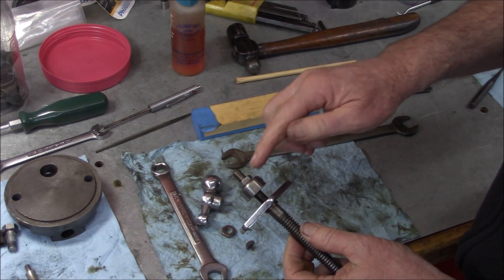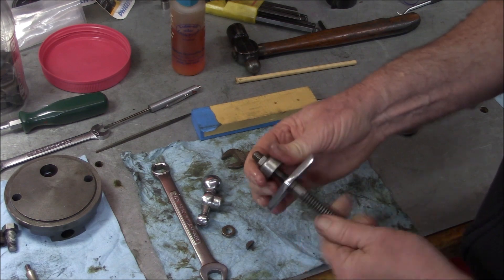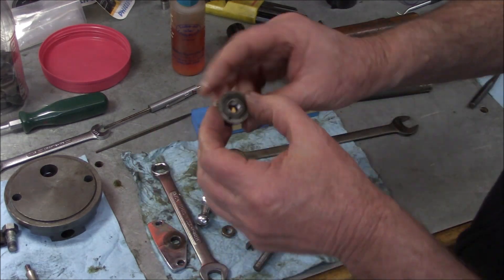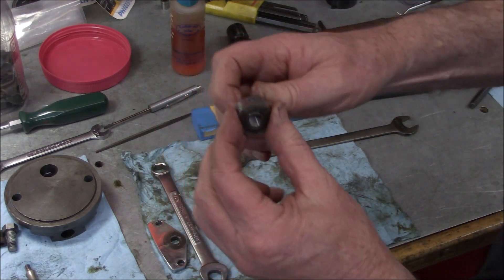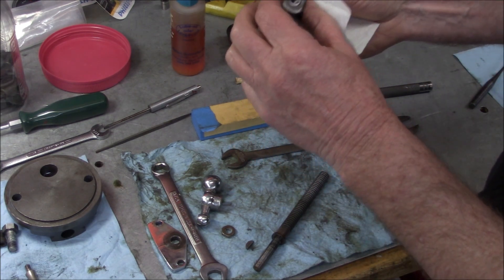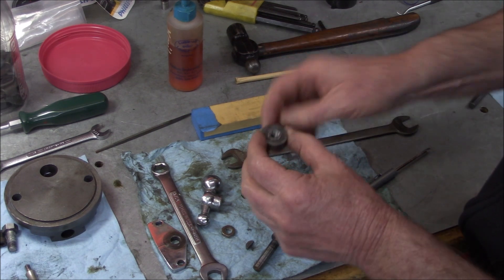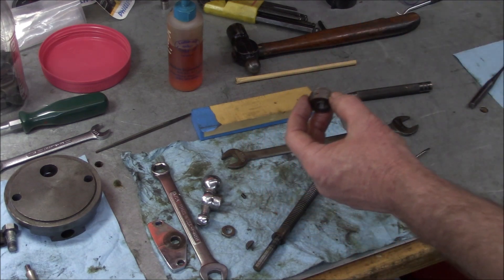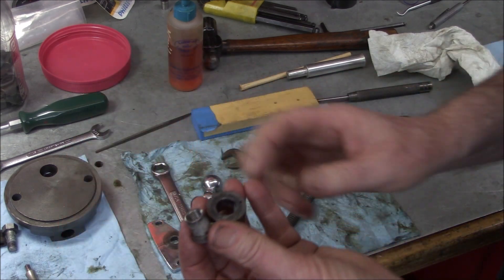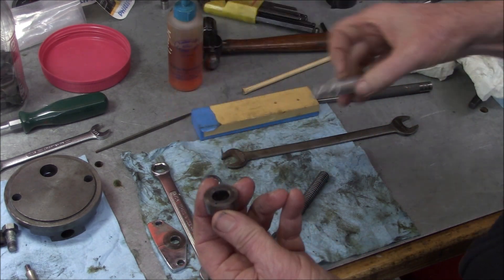The nut and the scale here are coming together - I think it's an assembly. This is frozen; pretty sure it's supposed to turn. I'm going to try to hold this in the soft jaws and punch that out. No problem - I just used an aluminum punch with some Nozilla and punched it out. It wasn't that bad.